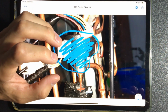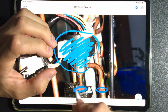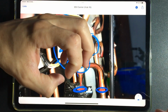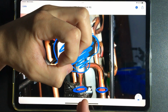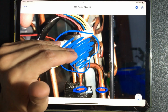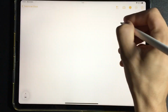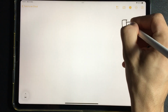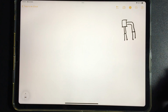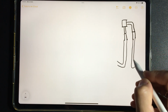In fact, if you have an assistant who is sprinkling water on it while you are soldering at these points. The problem is that the position of the valve is always like this, standing, and when you wrap it with the cloth, it drips and cools the weld, which makes it take longer to solder and the heat reaches the valve and can damage it. A tip from me is, originally we have it in this position, and at this point we have to solder. And here the air conditioner continues, these pipes will continue and will go around below and go to different parts of the piping.